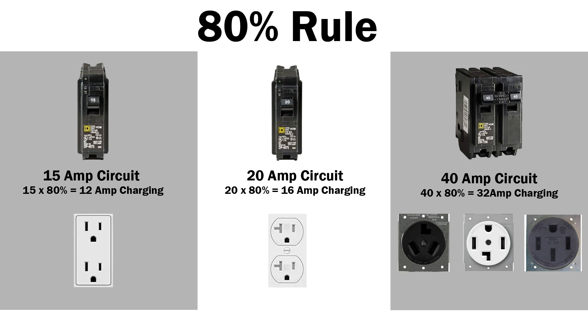When looking at 240 volts with 32-amp charging, don't think that a 30-amp plug will work — you cannot charge at 32 amps from a 30-amp circuit. You will need at minimum a 40-amp circuit to get the full 32-amp charging capability, which is 80% of 40. Hopefully that gives you some insight into what to use and what your maximum capacity is. Following this 80% guide, you're unlikely to trip your circuit, and it's a bit safer.